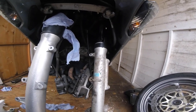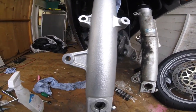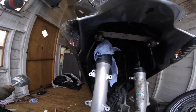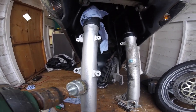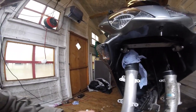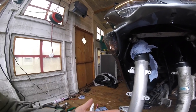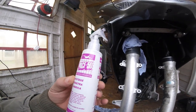What I do — if you look at this one so far — I use a wire brush on a drill at a very low speed and just go around. What I do is remove the paint so it's back down to its natural state.